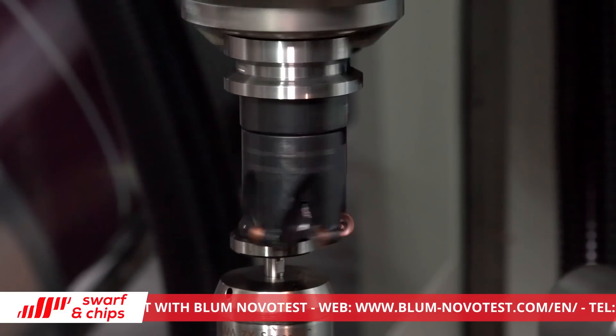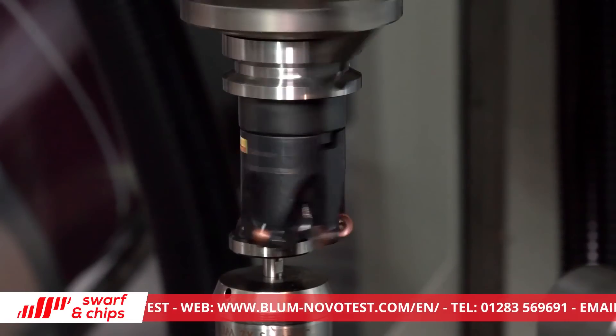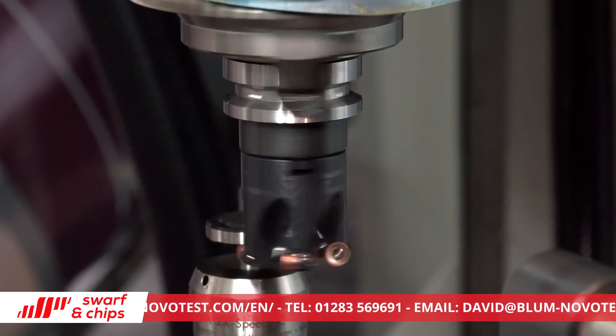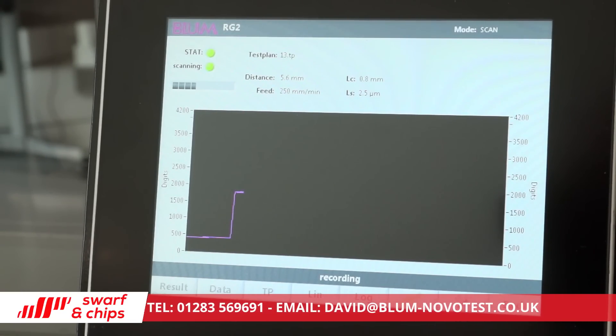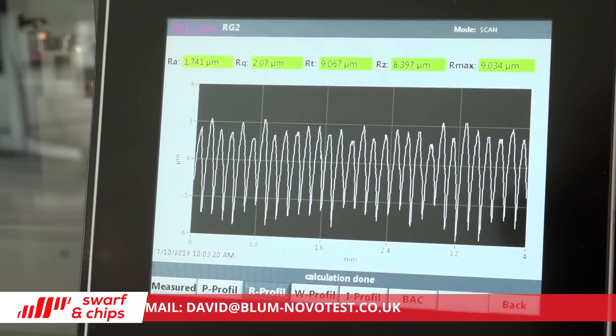So if you had a complex component, you'd endorse measuring on the machine - both the cutting tool and the workpiece. Can you pull reports off? A lot of customers now want to see a measurement report. What we often do, especially with the DigiLog range of products, is integrate our own IPC and touchscreen into the system. That gives you a graphical picture of the tool or the workpiece that you're trying to measure. Once you have that data, you can download it and send it to a network PC or an external device so you can monitor it and check it after the machine is in operation.